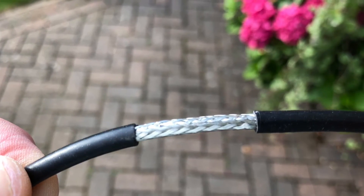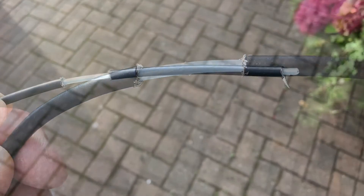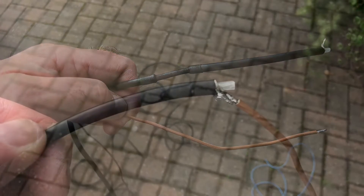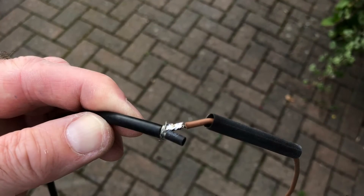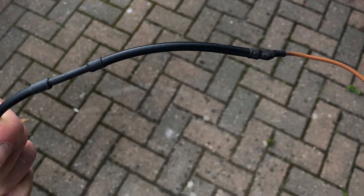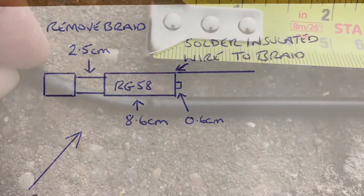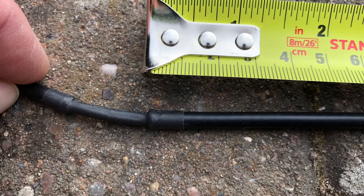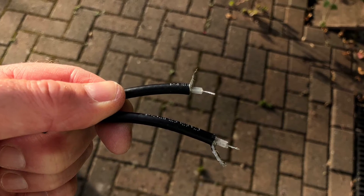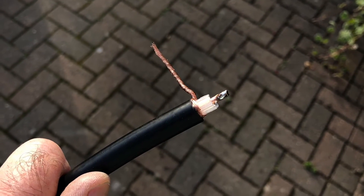On with the build. This is the top end of the coax: the 2.5 cm section of braid is revealed and cut away neatly with side cutters, leaving the centre in place. The tip is then tinned on the braid ready for connecting the insulated wire. Join them together and use some shrink tube to keep both the tip and the join weather protected. Here you can see the finished article with the capacitor in place and the cut section. For the bottom of the antenna, measure down from the base of the capacitor 126 cm for the cut to join the stub — leaving two bared-off ends of RG58, which you tin up. Also prepare and tin the end of some Westflex 103 ready for connection.